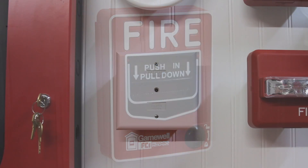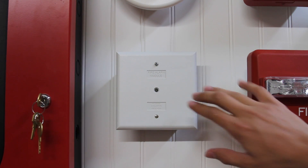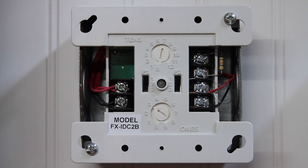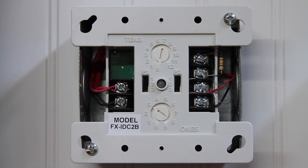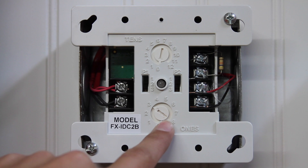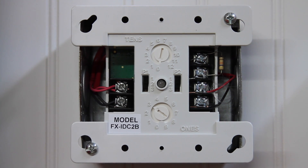So how did I do that? The answer is actually this module right here. Let's open it up and have a closer look. This is the model FX-IDC-2B Fire Alarm Module. I always knew that this could convert conventional pull stations into basically addressable. But in order to do that, you had to program that in on the panel itself, and figuring that out took a while. But I had some time and went ahead and did it, and now I can have conventional pull stations, smoke detectors, or any of that on this panel.